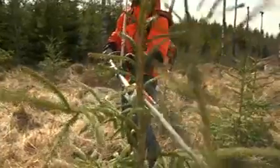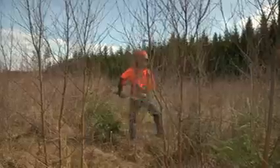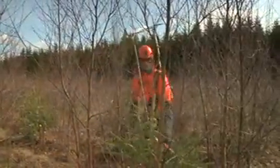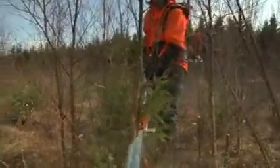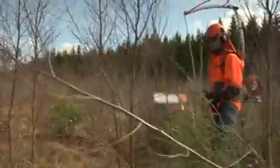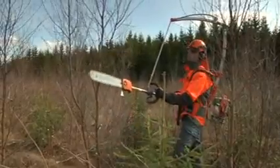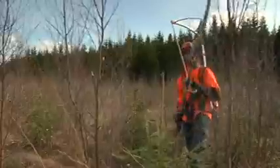Cutting with the backpack chainsaw is essentially free from kickback, thus minimizing the risk of hitting stones. The backpack chainsaw is especially suitable for spot clearing and spacing of low shelter wood. Spot clearing entails clearing away deciduous brushwood with a radius of about 50 centimeters of the plant, whilst leaving the rest. A few years later, a second cleaning is carried out until the final plantation is formed.